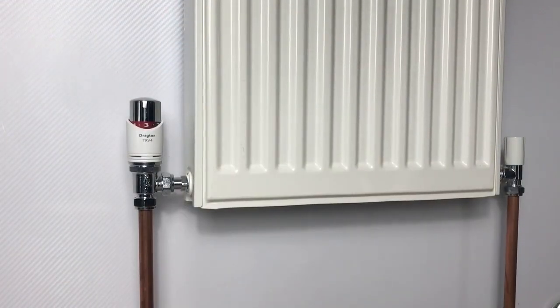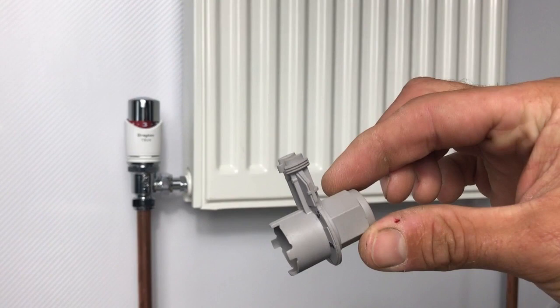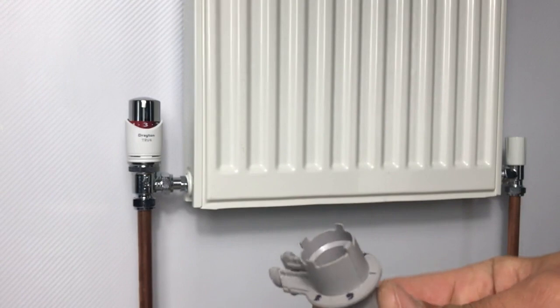That's the traditional method of balancing using the lock shield valve, and you'll need to do this if you install fixed flow rate bodies such as those supplied with the RT212. If you install the RT414 or the TRV4, these come with the EB body, and using the pre-setting key you're able to balance on the TRV body itself. The bodies that come with the RT414 and TRV4 are variable flow rate, so the pre-setting key can set the balance.